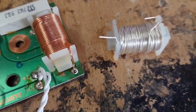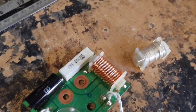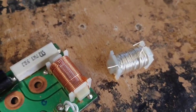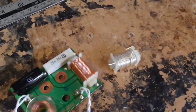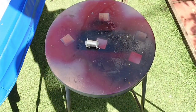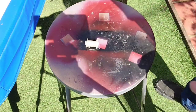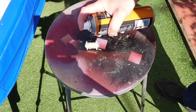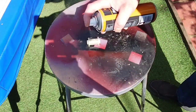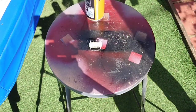I've finished the winding now. It is slightly different although it is exactly the same length. Now I'm going to cover it in spray — using this enamel spray like I showed you before. Just give it a good blast, pile the lacquer on, turn it around. What this will do is help to seal it all in place and hold it in place well. We'll give it about three coats.